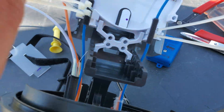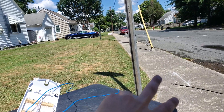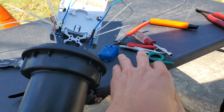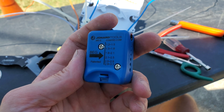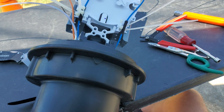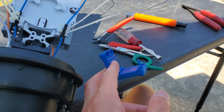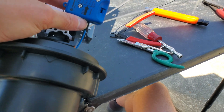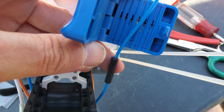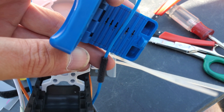Almost done with the build. Because this is a lateral, this area is going to be blue, and the next block down is going to be orange — so orange won't even get landed here at all. About to use the Jonard MS6, which is about the best tool ever invented. There are a couple different ways to do this, but this is by far the simplest — literally five seconds. I always put the felt on so I have something to grip, clamp it down, and we're going to do a mid-slit entry.